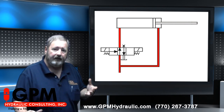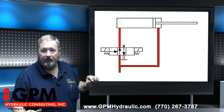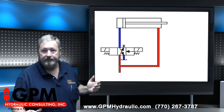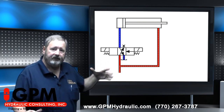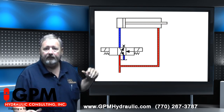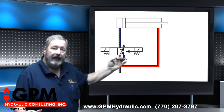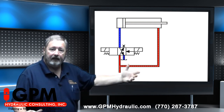To retract the cylinder, we'll energize the B solenoid. That will shift the valve to its B or crossed arrows position. The B port is plugged off, so we're not applying any pressure to the piston side. We'll just drain oil out of the piston side through the A and the T ports, and the cylinder will retract.